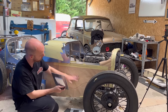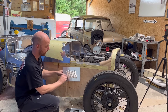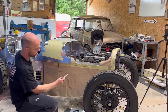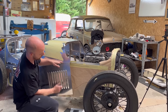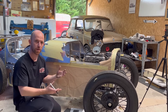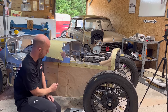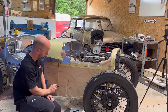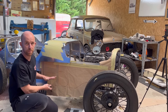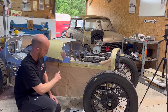I've got this whole area in between the lines and that's just going to be a flat space. I'd like to possibly take this bonnet line here, incorporate that into the louvers — just angling them slightly — and maybe add that through the side panel there. I may even go into this slightly larger area here and possibly fit a few larger ones in. There's no rush to do any of that, but now it's all coming together. This area here is going to be the blister — it will be cut out, but only up to this point. I'd like to do a tear-shaped blister, but I don't need to cut this whole area out — it will just be false and for visual effect. So this is the only area that will effectively be cut out.